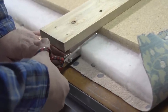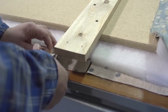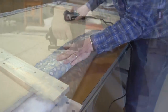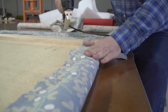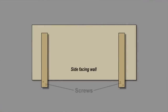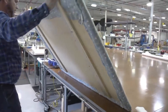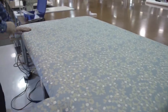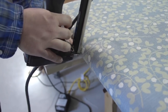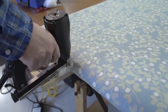He'll have a cutout for the legs that will be used to attach the headboard to the wall. Now he'll simply staple the bottom portion as he did around the other three sides. Next we'll show you an illustration of how Brian is actually going to be hanging this headboard. Those boards on the back side will be used at the bottom with screws that will screw into the wall, and at the top of those boards he'll install hangers where he can hang the board. The bottom edge of this headboard will not be visible — the mattress will be there — however Brian is still going to upholster where those boards have been attached, securing a few staples. This is where he will screw those boards into the wall after the headboard has been hung by the hangers at the top of those boards as illustrated.